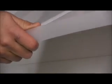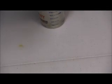I'm going to take this container here and put as much of this fluid as I can without dripping it all over the place. Kind of give you an idea of what I applied, okay? So once again, let's pretend that I had a couple of trimmings here. So this could right here be about 6 pounds worth of trimming. I sprayed one side, turned it around, sprayed the other side. Let's say that I used a total of 3 passes to get this area sprayed, okay? In those 3 passes with that flow rate, I only applied 6 ounces, okay?